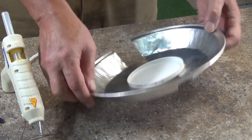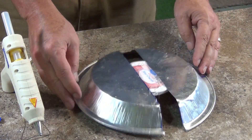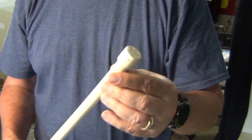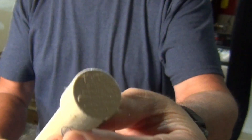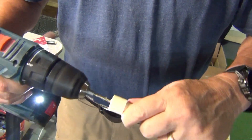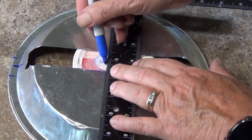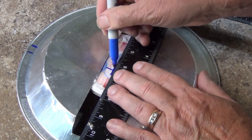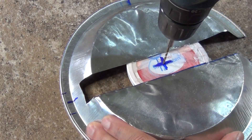I need to give the glue a little time to cool down and harden, so in the meantime I'll prepare my mounting mast. I attach the cap on the piece of one-half inch PVC then drill a one-eighth inch hole in the middle. Next I measure across the edge points and mark the center of the pie pan on the plastic lid, then drill a one-eighth inch hole through this mark.